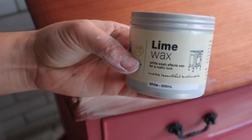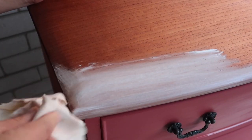At this point I just wasn't sure about the colouring. I love the colour on its own, but in the whole of this dresser I just felt it was almost too much and overwhelming, but I really didn't want to repaint it and I really wanted to see if this was something that would actually sell. So I pushed on through and then decided to hemp oil that sanded cedar top. I absolutely hated it. The colour was so rich and dark and I just wasn't feeling the combination between that dark brass hardware and that really strong chocolate timber top. So I ended up completely switching gear and thinking about what I could do to sort of soften it and make it a bit of a better contrast. I rummaged through my garage to see what other stains I had and thankfully I came across Gilly's Liming Wax and then applied that over the top once that hemp oil had dried.